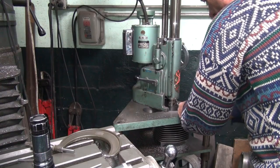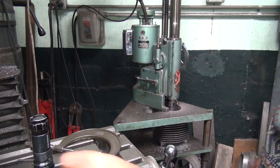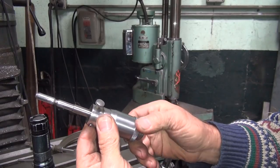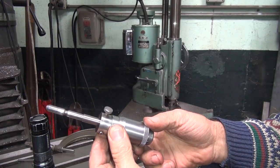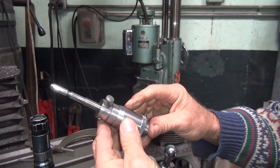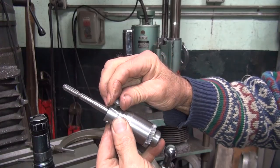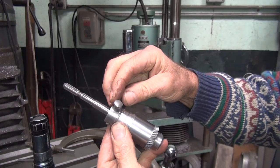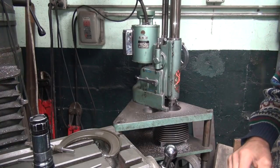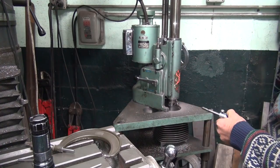Got to clean all the chips out of the inside of the hole because they fill up full of chips. We ran it right into a big pile of them down there which jams them up into the machine. Go ahead and give this another turn and a little extra - there's one turn, a little extra. I usually go about 18, then I'll bore it to about 22 or so. I'll back that off to 17, leave 3 to 4 thou for the final bore, and I'll leave 4 to 5 for honing.